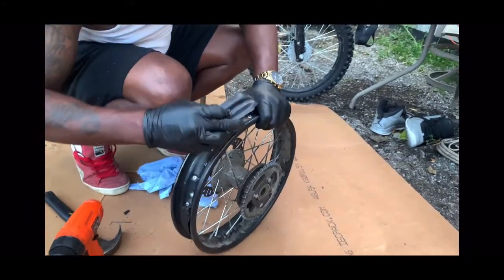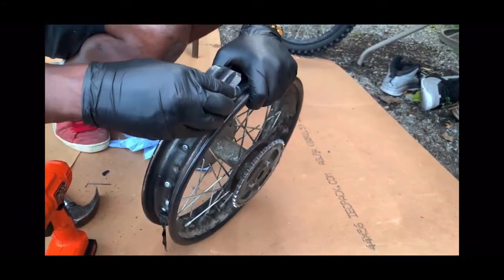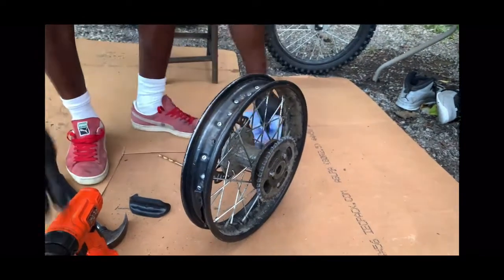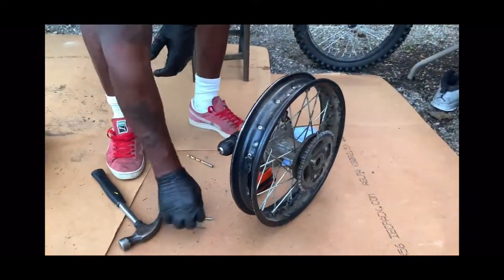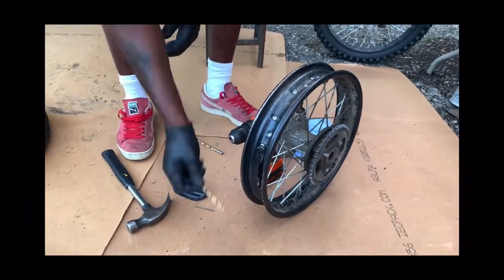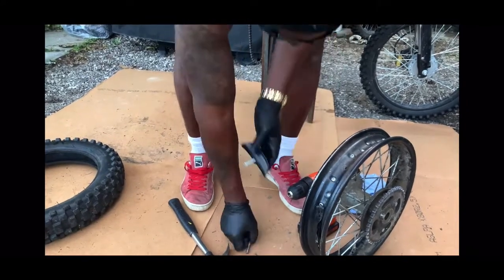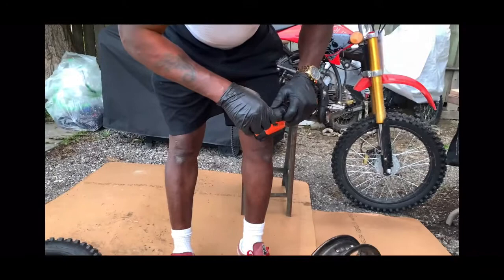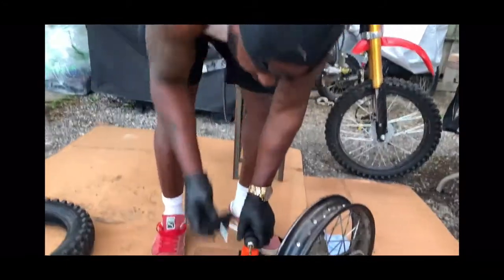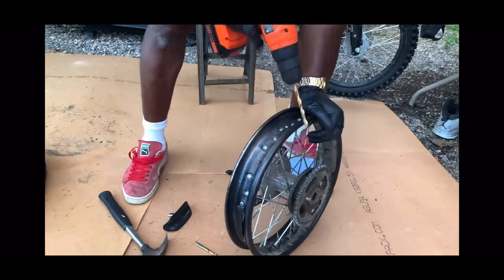This is the rim lock, and right now this hole is too small — we're gonna drill it out a little bit more bigger. We're gonna change the bit and use a bigger one. First you use a small one, then a medium one, then make sure this one is the perfect size. We don't want to make the hole too big — if you make the hole too big, this guy will just keep moving around. We want to make the hole exactly right.